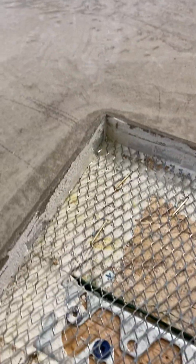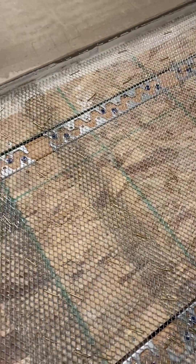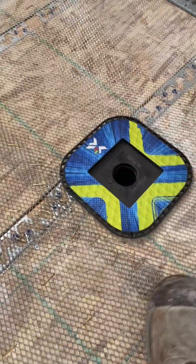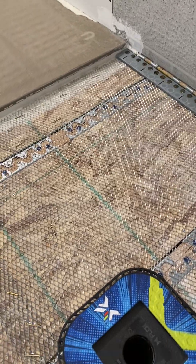It's been about two hours since I poured this. It's nice and hard. Popped off my dams. I've got about an inch and an eighth right here. I love this rapid recess system, but it really just barely gives you enough slope — proper slope. Usually when I do these, I end up floating the floor up a teeny bit more. Even with pushing this drain clear to the plywood, it's just the absolute minimum slope, and I don't feel comfortable with that.